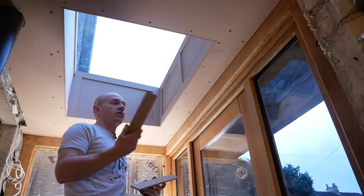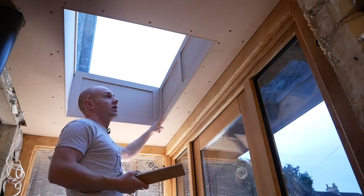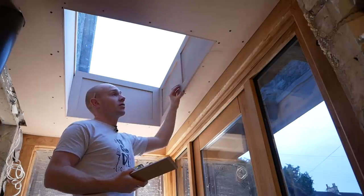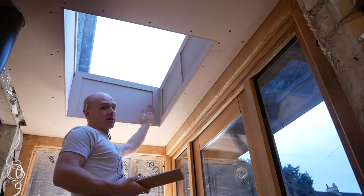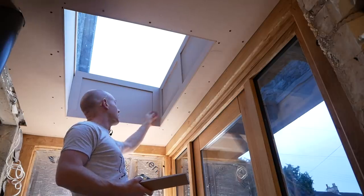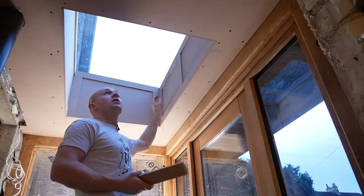Anyway, so what I've done is just trimmed everything out. As far as the details go, this is 60mm. It's basically the same as the shaker paneling I did in the room next door, albeit I've reduced it to 60mm. And in the corners, where you've got one piece butting up to the other, you just need to account for that. So I've done those at 69mm, so that the 60 piece sits in against that and they both end up equal.